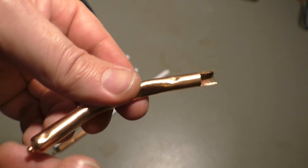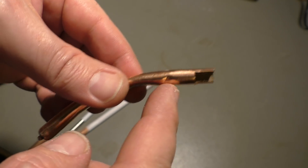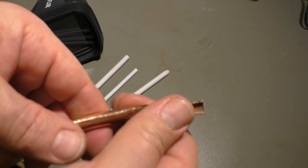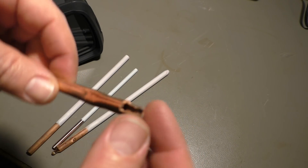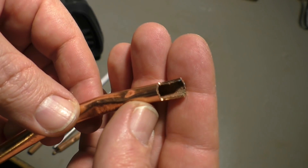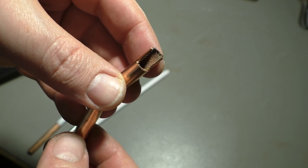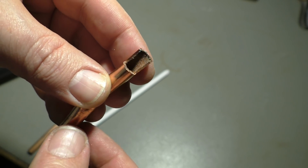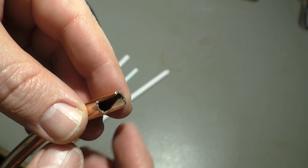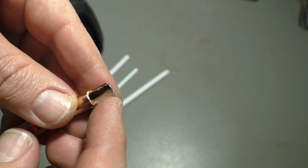The principle is relatively simple. There is one or two drops of water inside this tube, then the air is sucked out by a vacuum pump, and that's all. Water has the property that it boils at a very low temperature when the air surrounding it is pumped away. So in a vacuum, water can boil at room temperature or even lower.